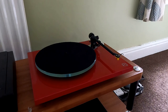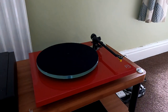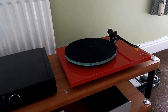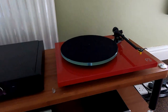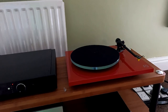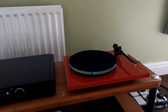I'm just trying to work out how to do another proximity effect, really, because it's not just the equipment itself that can create noise. There's other household things. The biggest problem nowadays, actually, is things like Wi-Fi routers and that sort of thing, and they're more of a high pitch. Well, it's a bit like an earth noise, but an earth noise is a bit like a sort of high pitched off-tune radio, if you know what that sounds like.